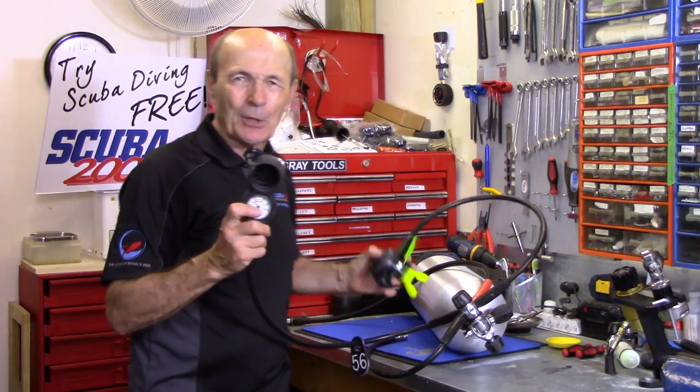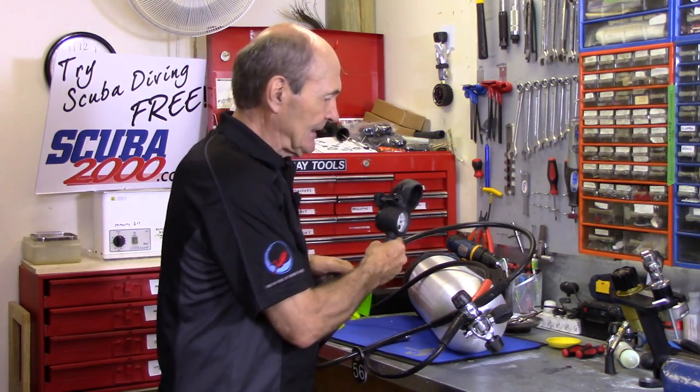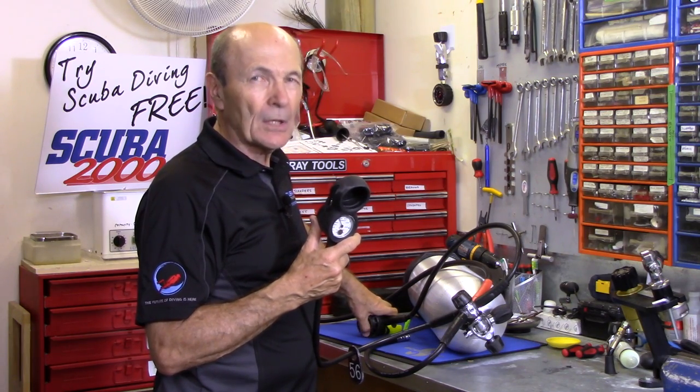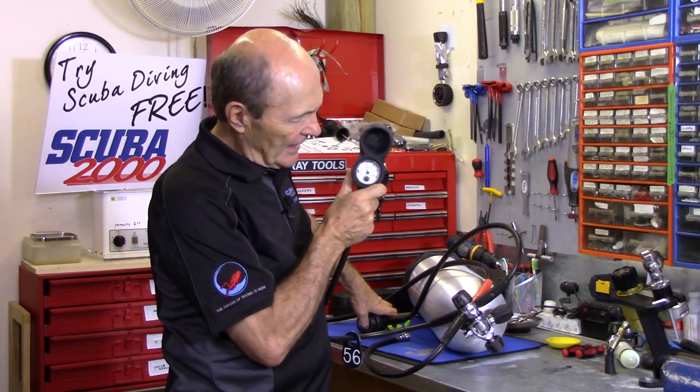It takes a few seconds. Why? The valve's not all the way open — that's exactly what happens. We have this discussion all the time about valves and whether you should turn it back a half turn, a quarter turn, or turn it back at all. The answer is no. You don't need to turn it back. When you open the valve on your scuba tank, open it to the end. Don't jam it open — just open it until it stops and leave it there. Don't turn it back. If you have any restriction in that valve, if it's partly or completely closed, here's what happens — see it dropping?